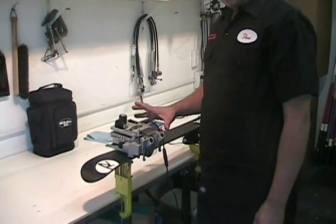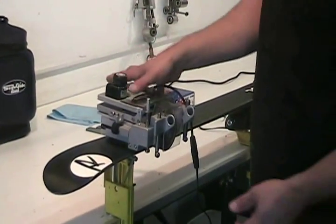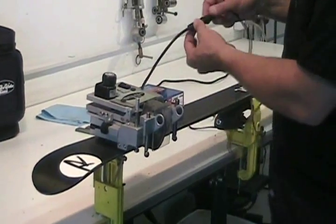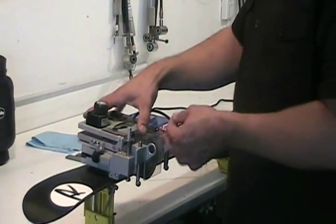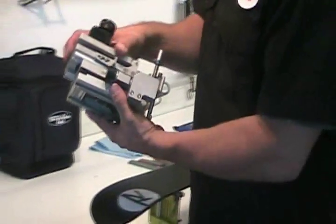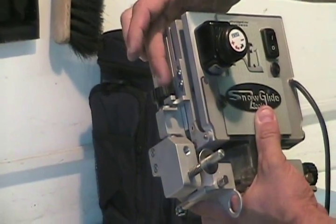I'm going to show you how to take your Snowglide machine and set it from side edge setup into base bevel mode. The first thing you need to do, and very important, is disconnect your power. It's very easy to hit the power switch while you're making the switch over from side edge to base edge setup. First step is, you want to take the large screw with the black top on it on the left